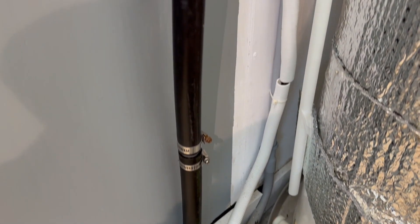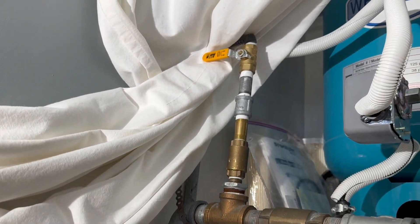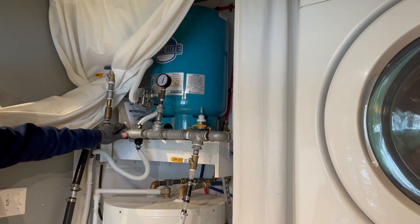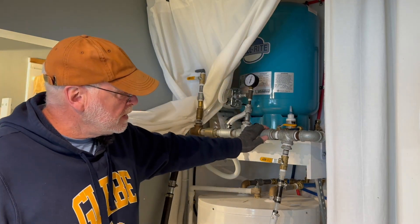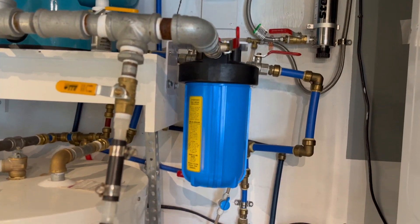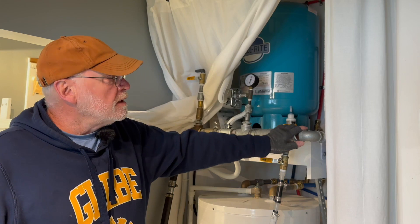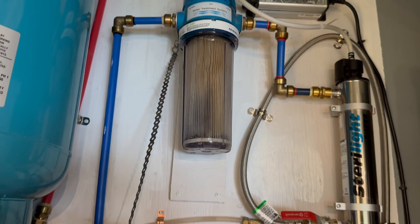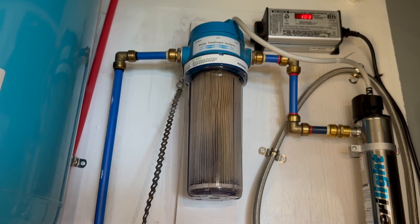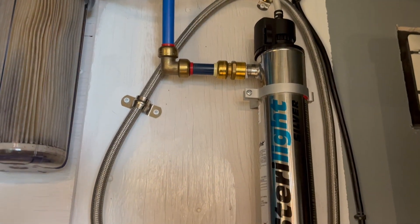So we're now inside the house and this is the feed line that comes from outside from the lake. It runs up to this assembly here — this is the hardware that allows the drain-back system to function during the winter. It's a pretty simple operation. There's a five micron filter here that handles essentially all of the water that runs into the house, and then our system — we've broken the drinking water system into a separate loop — so we have a one micron filter up here and then the UV sterilization is just over here on the wall.